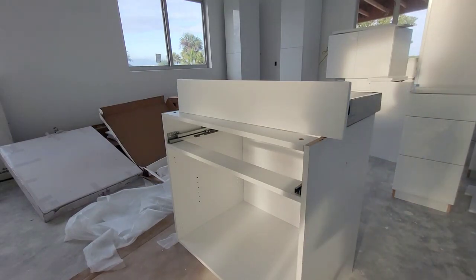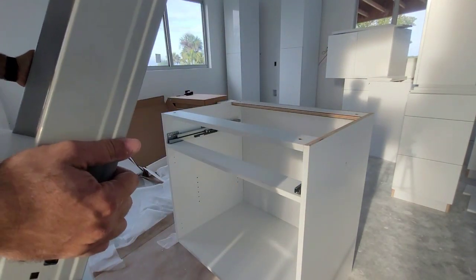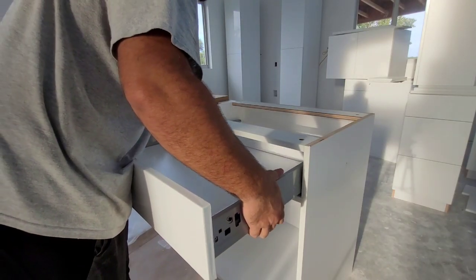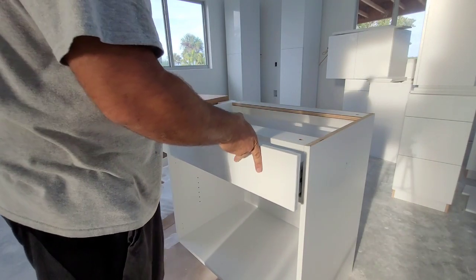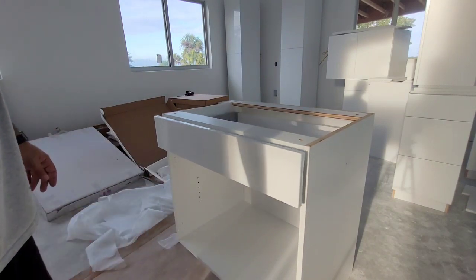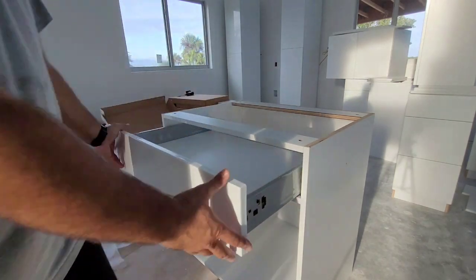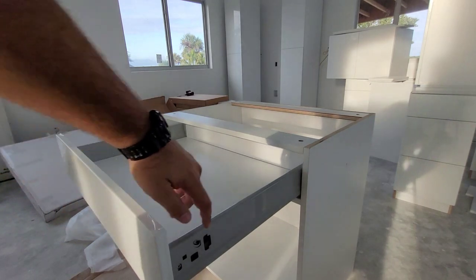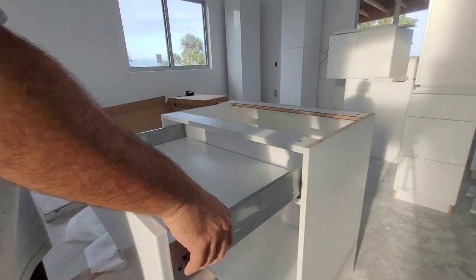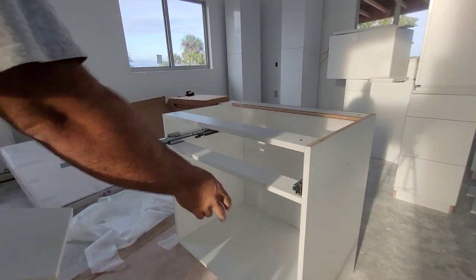Now we got the cabinet finished. We're going to slide it per the instructions - there's not much information about this but really you just kind of put it over the track. Make sure it's on top of it, make sure it's square. Slide it all the way back and when it gets all the way to the back you hear it click. Then you can make sure everything's working good - make sure the soft close works and that it's level to the sides and to the bottom. In the back row there's a little plastic tab - that is what you would use if you want to take the whole drawer apart if you mess something up.